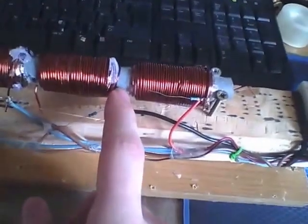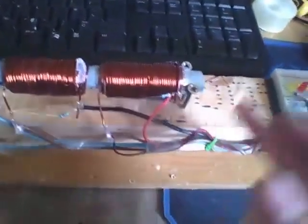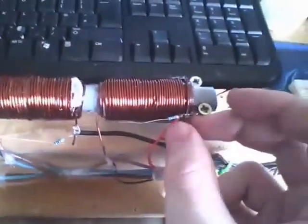I have photodiodes on one end and infrared diodes on the other end as a light barrier. The LEDs will be continuously on, and that will cause the photodiodes to keep the transistors continuously on, which will keep each coil on. Then the projectile will get sucked into the middle of the coil because of the magnetism.